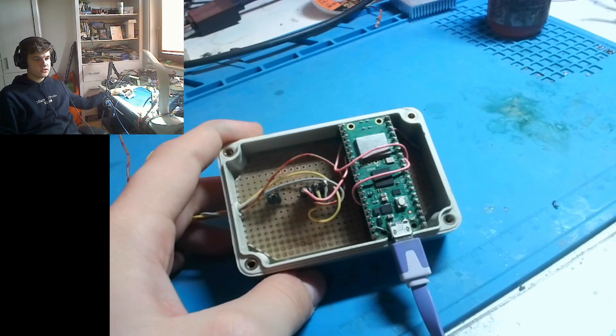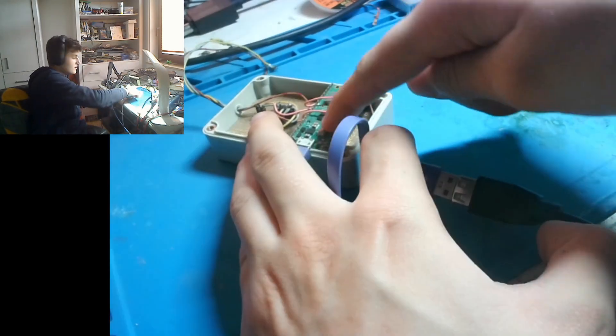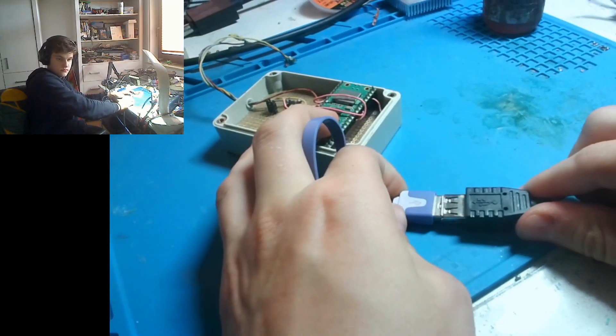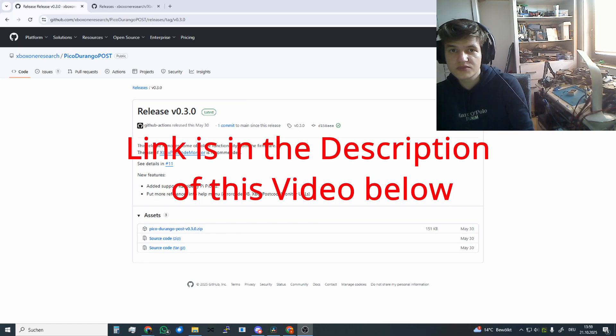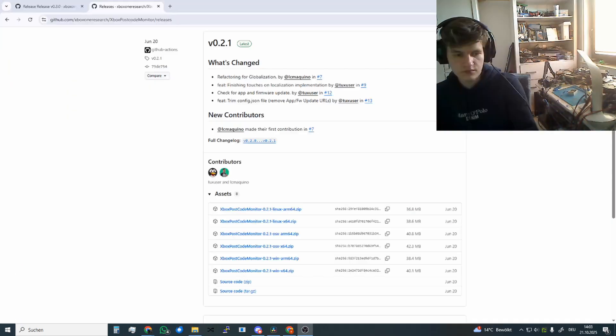All you need to diagnose your console is this $5 microcontroller. Press and hold the boot select button while plugging it into the PC and you will see this window appear. Download the latest PiCo firmware from the first link below by clicking this button, unzip it and drop the UF2 file into this folder. The PiCo will now disconnect and the PiCo is set up.